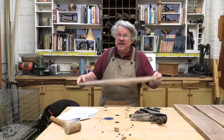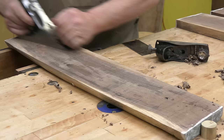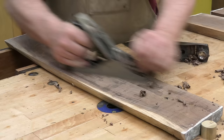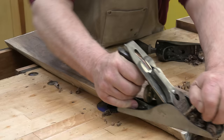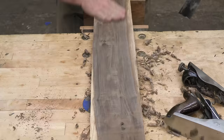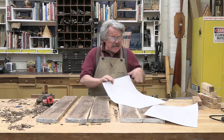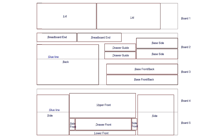Let's start with some intensive planning. This is doubly important because the materials are scarce and limited in size — I need to know which boards I'm going to use to make what piece. It helps to give some pieces a few licks with a bench plane so you can better see the grain and color. I also need to pay close attention not just to grain direction, but to color and physical appearance. The grain may appear more variegated than wood from a larger log — especially with walnut, where the sapwood is a completely different color than the heartwood. I made a 2D drawing showing where I'd get each part, with boards numbered in blue and parts called out in brown.